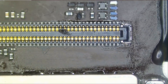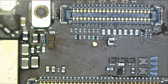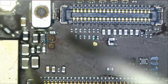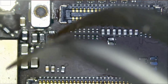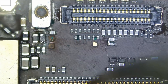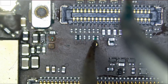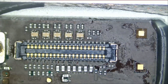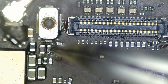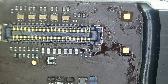Already I see signs of flux here and I see a couple of issues. I see a missing backlight filter here and I see what looks like solder mask — it looks like a repair was attempted on this tablet. I see a bridge here, signs of solder mask here. The FPC connector looks good. We do not know if this component is good or not. And that's basically what I see wrong with this tablet.